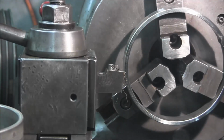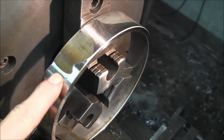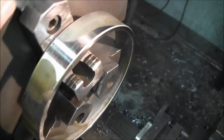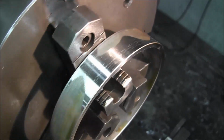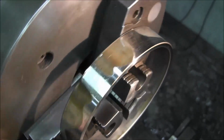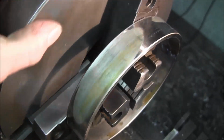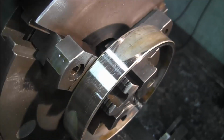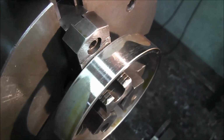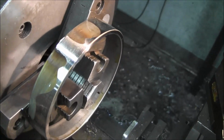Okay, I'm going to bring you in here closer. Okay, right there was our weld. Of course, how light it is, you know that we're going to be touching at all three of those points there of the jaws. Okay, but that's pretty darn close for just barely starting to skip all the way around. Take another 5 thousandths and almost have it, you know, clean up that way.